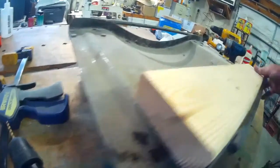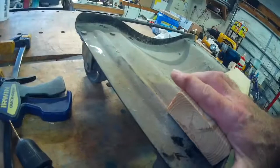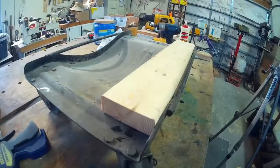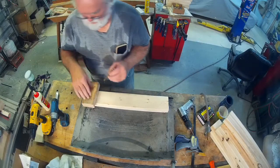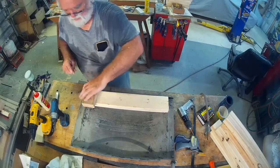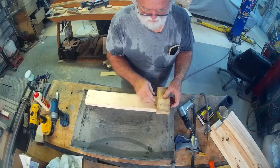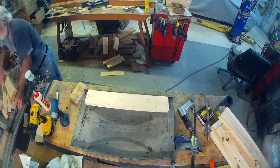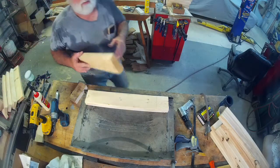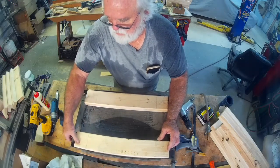I'll get these things and start putting them together. You can see it drops over the heads of the bolts and locks itself in place. I have to offset the two-by-fours a little bit — I had to keep them short because I didn't want them to stretch over that ridge. So it made me a little block that's the proper dimension so I can line them up and put these cross beams on, offset them just a tick.